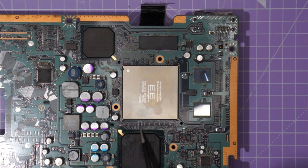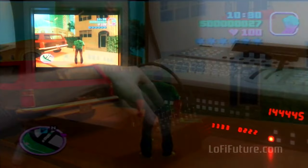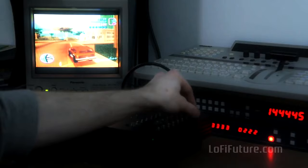Because the data these two chips are trying to communicate is actually complex physics and 3D graphical information, when we short circuit these resistors it produces some absolutely wild effects on screen. This can range from polygon stretching and warping to texture and shader glitches, and even these crazy video feedback loops you'll find sometimes. It varies from game to game quite a lot — some games do tend to crash with certain glitches, but some like Vice City can take so much glitching and then you can flip all the switches to off and the game's pretty much back to normal again.